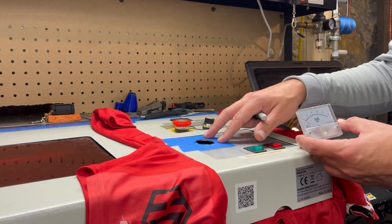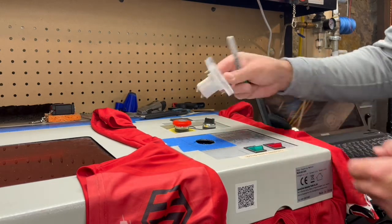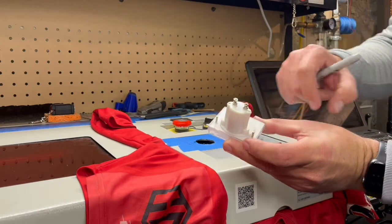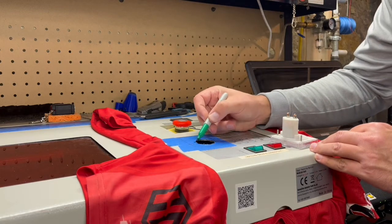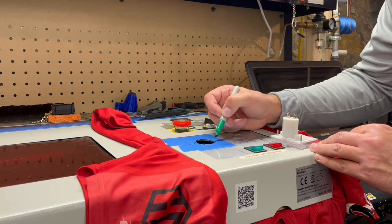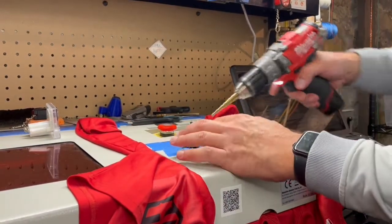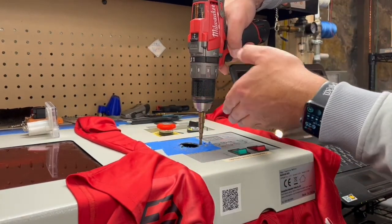We drilled the hole — that bit ate right through the metal, no problem. We went with the smaller hole, so the only thing we have to do now is make a couple small reference marks for where these little pieces notch out and where the screws pop out. I'm just eyeballing it, don't have to get too technical. We're gonna get a file and just file out a little bit to get this to fit in flush. We were gonna notch that out with the file, but I'm actually going to drill a couple of quick little holes to take off the material, then clean it up with the Dremel tool.